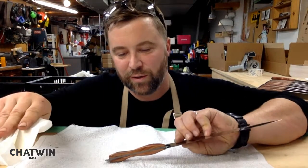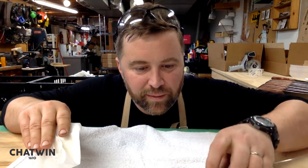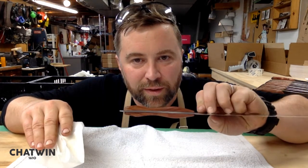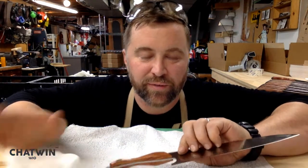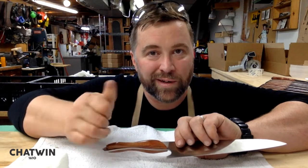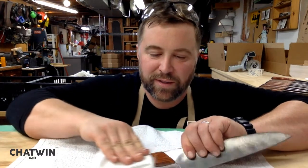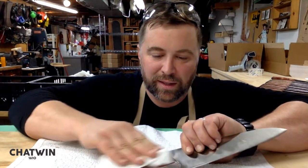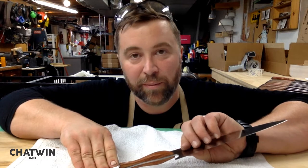This one here has a nice tone, and when you oil it, you'll see that it darkens a little bit. See the comparison here. And it'll darken over time too, especially if you use it with your hands and you have some oil or grease or cooking stuff on your hands. The wood will eventually darken. Every wood does. And with oil, it'll protect it, and then it'll give it a nice patina. It'll give it a bit of a shine.